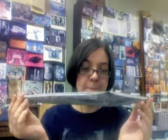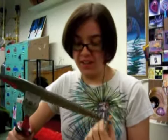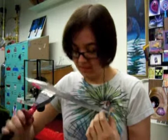Here's the blade with the finished ends — I think they all came out pretty good. After talking to Jack, he first called me a rascal for getting it done so quickly, and then told me it wasn't done. It turns out you cannot have multiple facets on the edge, which this does, except for one edge. So I've got to go back to the grinding wheel — hopefully we'll get a nice uniform edge now.